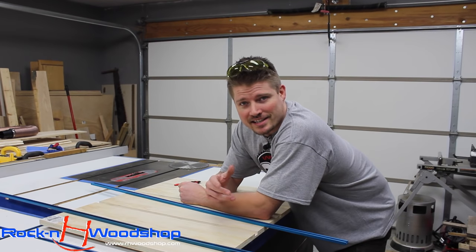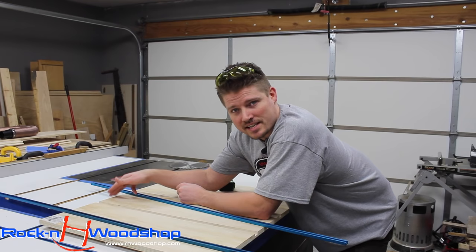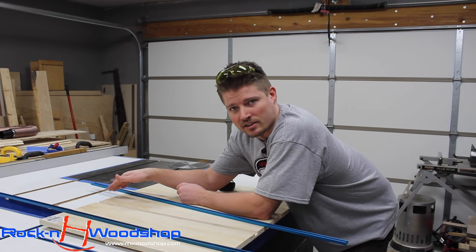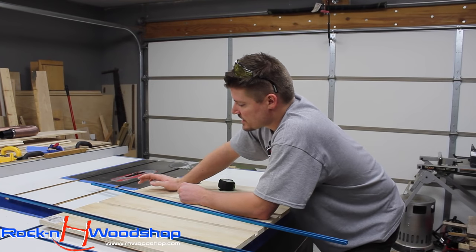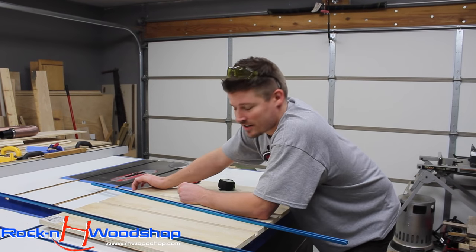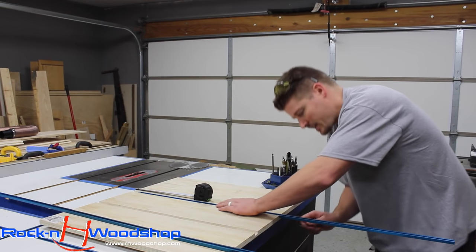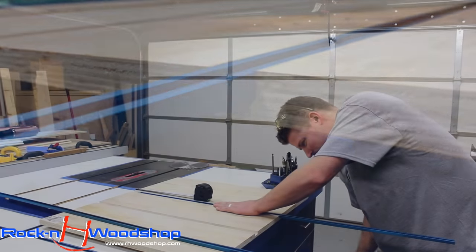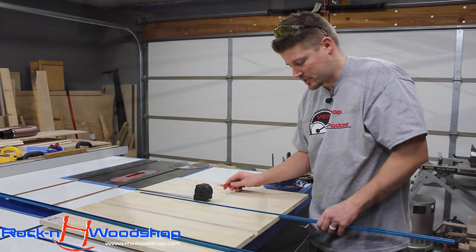The design of my sled is not a traditional one — I'm going to have a stabilizer bar in the front that's laying horizontal rather than vertical. In order to get bolts into the t-track, because the stabilizer bar will be covering the end of the dado, I'm going to back-set the t-track about an inch and a half from the edge. Then I'll take a fine blade, score-mark where the track meets the sled, and cut it at the miter saw.